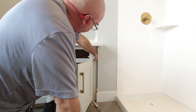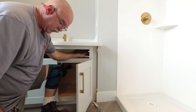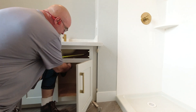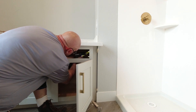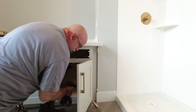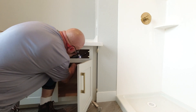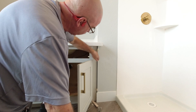Two down. Could I get away without putting a third? Sure. In this case I have room, so I'm going to go ahead. I have access in here through this side. If this were a smaller vanity and the sink was right tight, you may not be able to get that top screw all the way at the top. In this case I can get it quite a ways up there without hurting anything and without having to stand on my head. We'll put a third screw in — again, four inches. Use a beauty ring or reinforcing washer. And, ta-da! Now we're nice and tight, nothing's going to move.